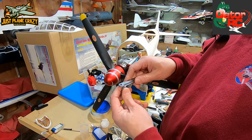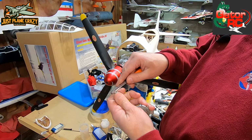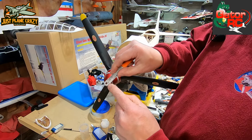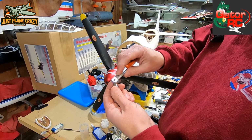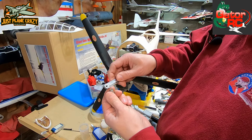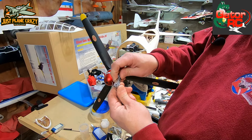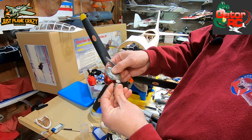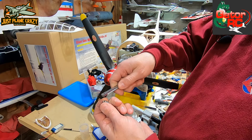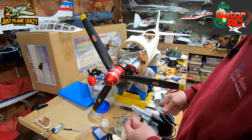Now when you go to set this, always refrain from using the ramp and driving it between the electrode and the ground side of this thing. Spark plug tool checkers have these little tabs, or in this case like that tab there, and all you're going to do is place that over that grounding tab and then just give it a slight pry and try it again if you need to open it. If you need to go downward and close that gap a little bit, then all you're simply going to do is use something like this and then turn, and that will push down on that tab. Do not bang on the spark plug in order to close it, and don't wedge it in there and try and pry it open between the electrode. That's bad for it. So our spark plug gap is set on this thing.